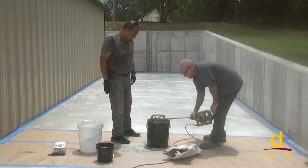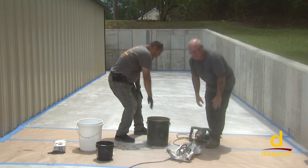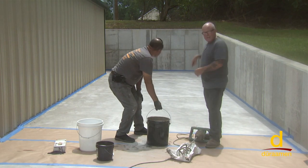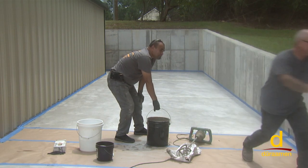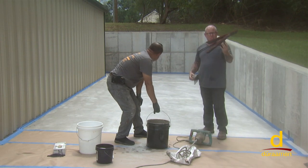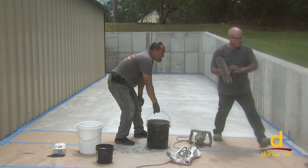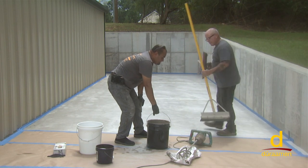Now, for the purpose of this educational video, we're just gonna show you a couple ways that installers choose to put it down. We always wanna do the edges first and then blend in the field area. And you can do that either by using a hand trowel, a magic trowel, and we're gonna show you also, for educational purposes, a rubber squeegee. So let's get over here and get going on this.